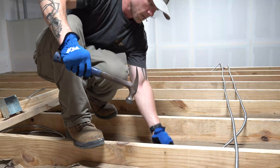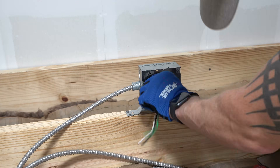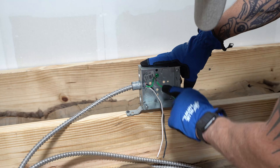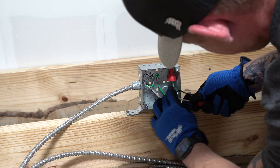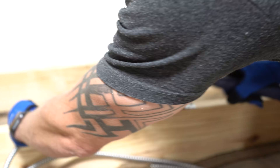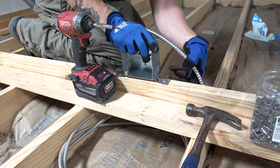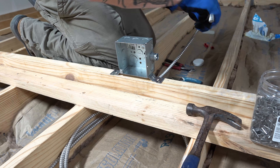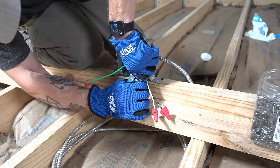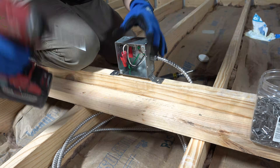I can move the switch legs around wherever I need to based on the space. The first box I put in place I make sure I screw it in and put a ground screw in the back of it. I also make sure that when I install the MC into the box, within 12 inches of the box per code I put a staple on it, and then throw a couple more staples on the actual loop of MC as well — I don't want that getting pulled around. The next one I'm putting relatively in the center of the room. This bundle coiled up will pretty much reach anywhere in that room, so I have the flexibility to do stuff.